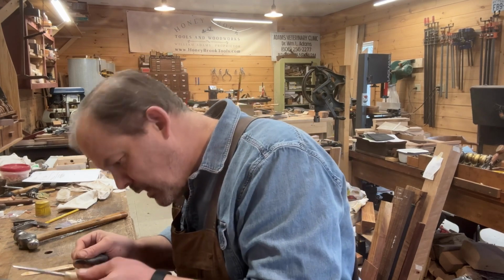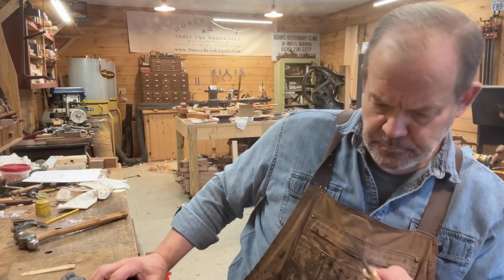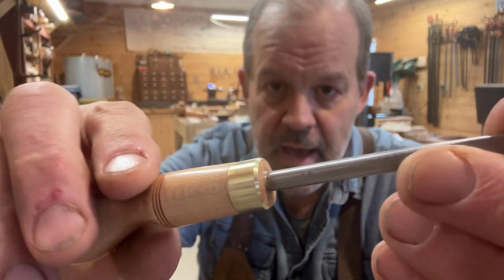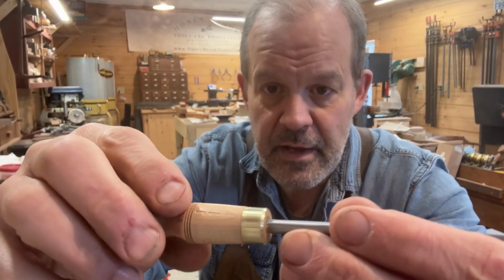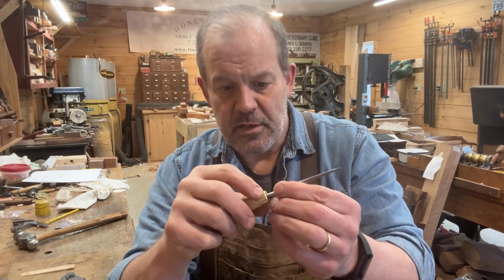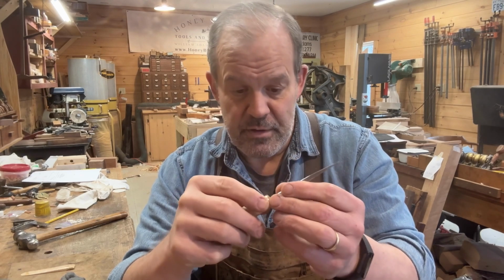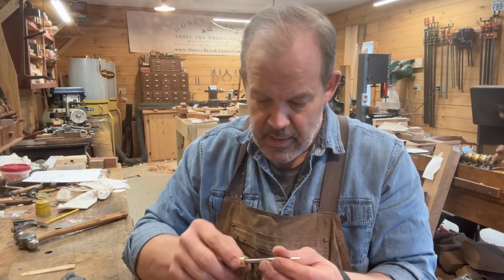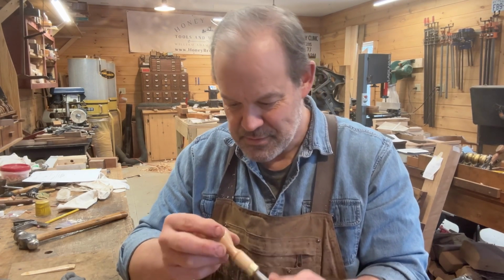And one thing I don't know if is picked up on the turning part of my video, but you may see at the edge, I put a little chamfer on the edge of that. I just think from an aesthetic standpoint it looks nicer to have that little detail there. And you might have also noticed while I'm turning the handle, I'm constantly checking this little seam right here, because if there's any discrepancy between the wood and the ferrule, the user will feel it, and I don't want that, because I just don't think it feels right in the hand if you've got that little discrepancy.